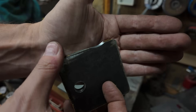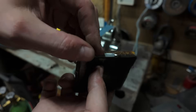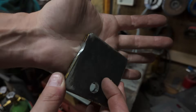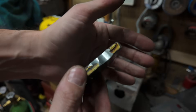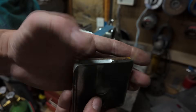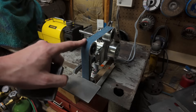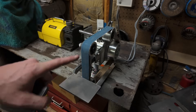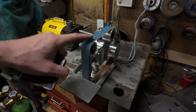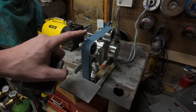I am genuinely impressed. Everything you just saw was 100% real time — I didn't speed anything up, I didn't do any editing. That is literally how long it took to remove that much material from that piece of steel using this grinder. For me, that is a huge, huge improvement. To do this type of material removal with the old grinder, you're looking at fifteen to twenty minutes just to put that chamfer on. Also, when I was grinding, I was putting a lot of force against the wheel — way more than I would ever be able to put against that old grinder — and I wasn't getting any indication at all that the belt wanted to slip or the motor wanted to stall. It was just powering through. To overcome the force of these pulleys or that motor, you would have to apply the kind of force that, quite frankly, you should feel uncomfortable with.